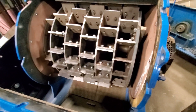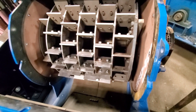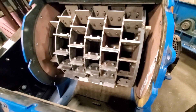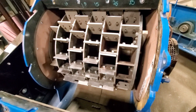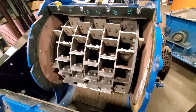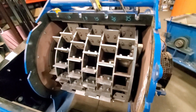What's nice about this versus a granulator: if you're trying to achieve the same thing with a granulator, you really can't get there cleanly. You can get close by just chopping smaller and smaller, but if you use multiple granulators or run the same granulator with a very small screen, you create a lot of heat. That heat deteriorates everything fast, slows down production, and can melt the plastic.